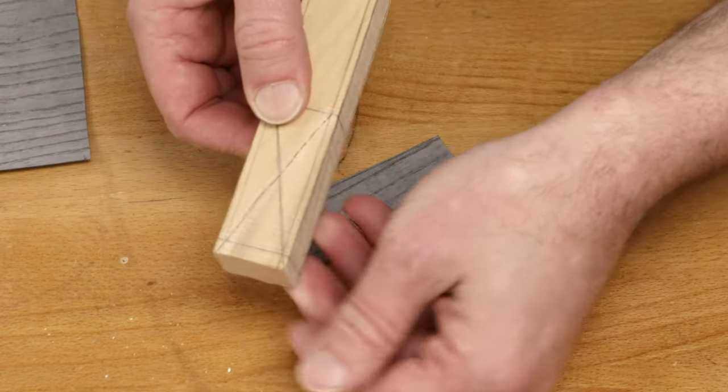Just opening up the cut like a little bird mouth, and sliding the veneer in — push it home until it won't go any further. Back on with the spring clamps. We're going to wait half an hour for that to go off. If you're getting into doing these, I recommend having another one on the go — by the time you've gone through three or four, it'll be time to get back to the original. We've got one more cut and one more piece of veneer to glue, and then we're pretty much done. We can prep this for turning — a bit of drilling and popping it on the pen mandrel.